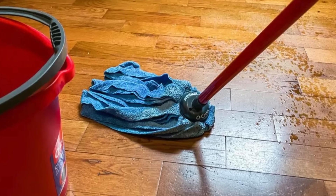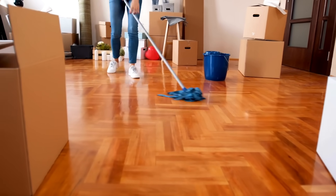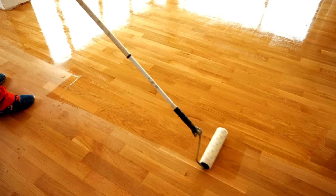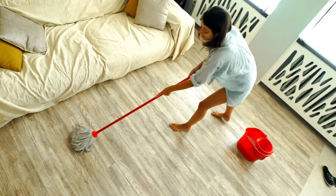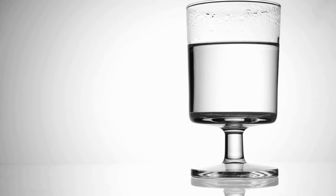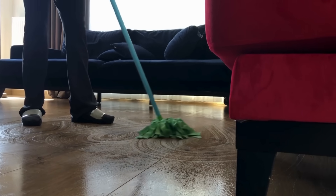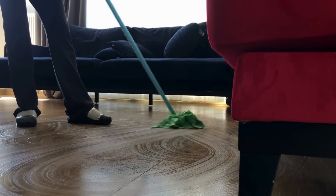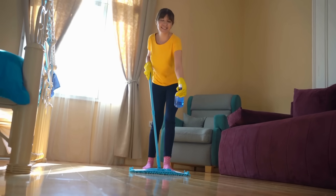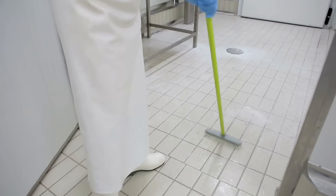Number 1. Hardwood Cleaner. Keeping your hardwood floors gleaming is super easy with this natural cleaner. This cleaner will leave your hardwood floors clean and shiny without causing any damage. Mix half a cup of white vinegar, 1 gallon of warm water, and 2 to 3 drops of lemon essential oil in a 2-gallon bucket. This simple mixture, designed for hardwood floors, is both gentle and effective. To use, dip a mop head into the bucket and wring it out well, ensuring it is barely damp. Mop the floors and repeat as needed.